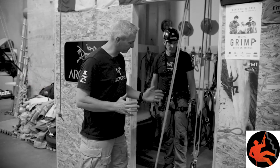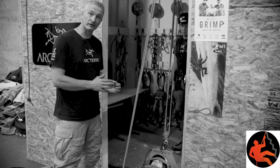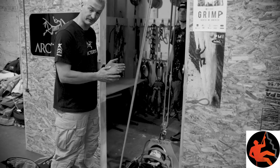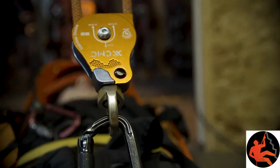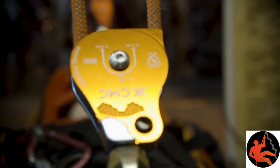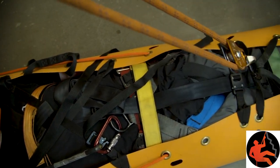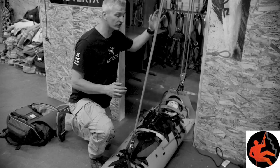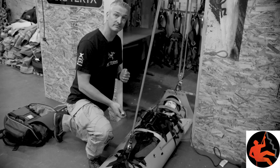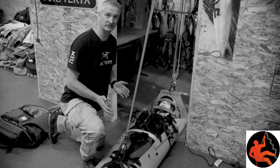So we've now taken our split 4-to-1 and rigged it up top in order to show you how this is going to look. We talked on the initial rigging about bringing the first one down to the feet. In this case, we've hooked the handles of the Sked. We've changed out the carabiner so that we have the black one at the bottom, and we've gone red for head, just so the rescuer in the space understands which one to hook up. Although you're just seeing a skills scenario, in a real-life rescue you're going to have a rescuer down here on a line, and you're going to be lowering these pieces to them, and they're going to need to hook them up appropriately. So identifying the carabiners is an easy way to do that.